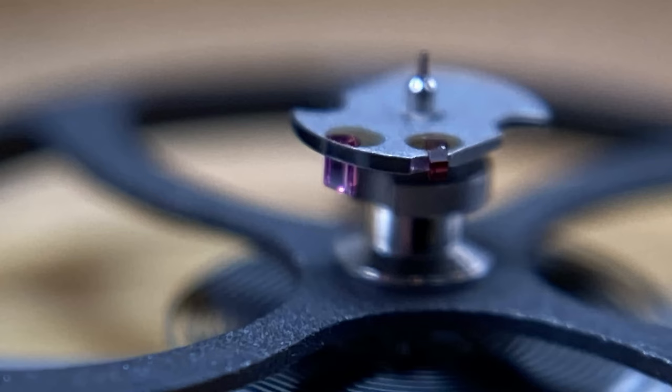What I've done here is use some pretty good macro lenses for my still cameras. I've removed the balance wheel and taken a couple pictures so that you can see the actual components in the watch, not just animations or 3D renderings. I've taken the balance wheel out and turned it upside down. On the bottom of the balance wheel, there are two red stones — synthetic rubies. One that sticks up parallel to the axle of the balance wheel is a traditional impulse jewel, just like you would see in the Swiss lever escapement, and this jewel receives the impulse in one direction from the pallet fork.